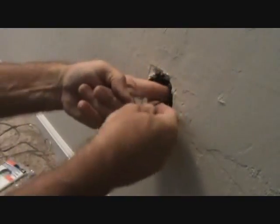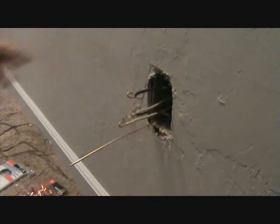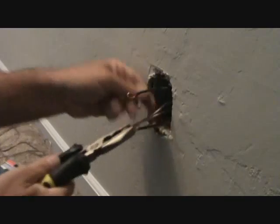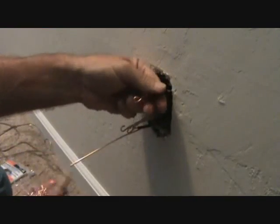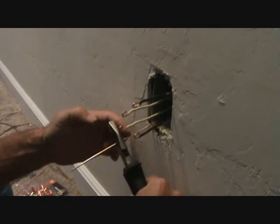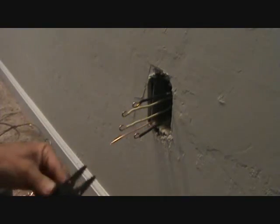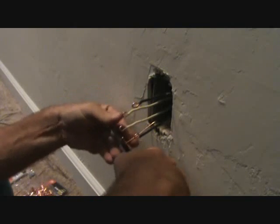I'll situate the black wires over here. If the curlicue isn't facing up, I'll take my cutters as pliers, hold the wire, re-bend it, and position it so it's facing up. Straighten out any crooked sections, then bend it so it's facing up. For the ground wire, I'm going to cut it a little bit longer — not very much — because I've got to allow for the curlicue. I make it about three-eighths of an inch longer, put it in the hole about an eighth of an inch, and bend it up. That's what you want it to look like.